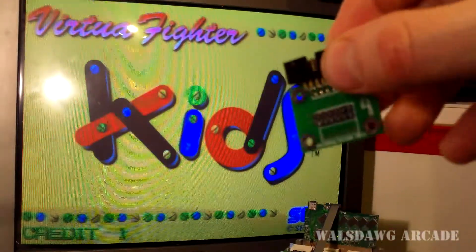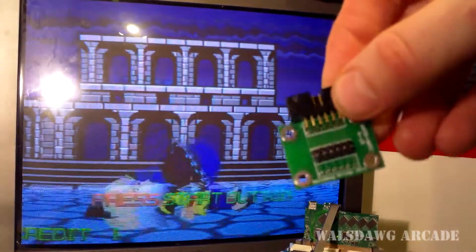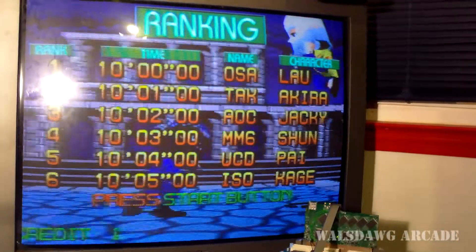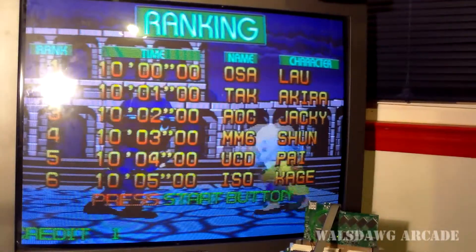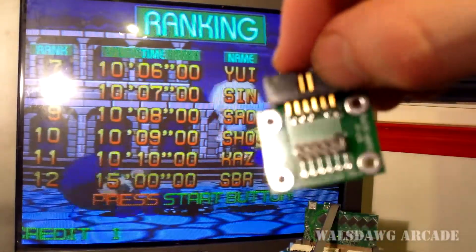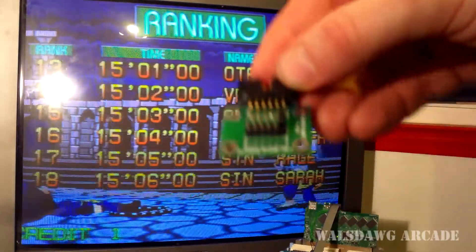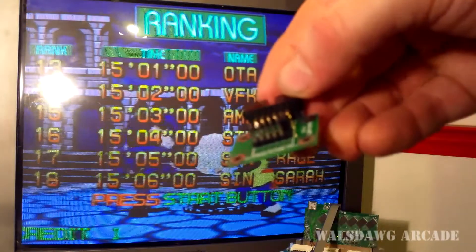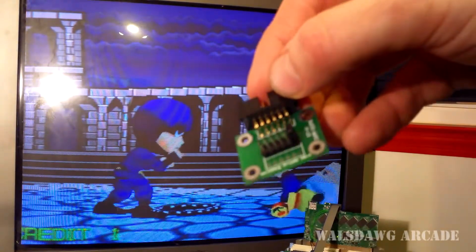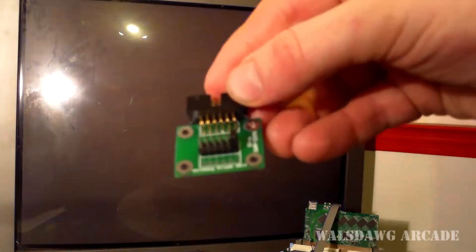There's also this version — I designed a little PCB in case you just wanted to have the jumpers moved to a remote area instead of having DIP switches. It's the exact same jumpers that will be on the cartridge. As you can see, you would just take your same little jumper that comes with it and it fits on there. Basically it's just an extension. The only advantage is that DIP switch banks could technically wear out over thousands and thousands of uses, which you'd never have with this.